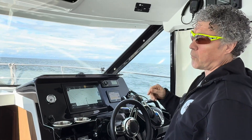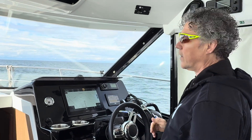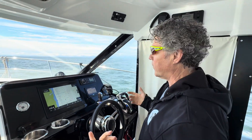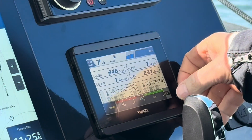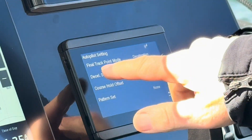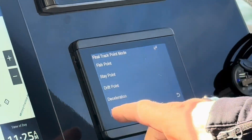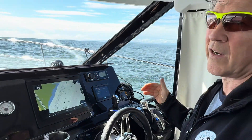We can change this option — if we want to just keep going, I'll go through the menu and show you the different options at the end of your route. To control what the autopilot does at the final destination, we're in our CL5 screen — the Yamaha screen. Hit the bottom right button, then the top right button, and now we have 'Final Track Point Mode,' currently set to deceleration. If we push that, we get all of these options. If I go to 'No Deceleration,' that means the boat will just continue on at speed when it hits that final destination.